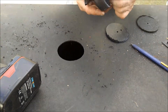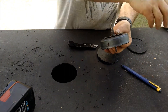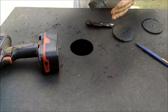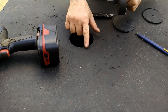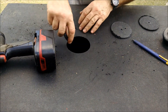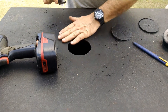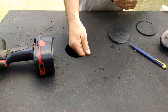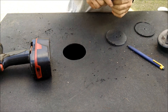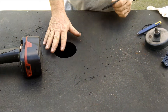The hole saw goes together with a piece for the inside, and for the larger size you use the other side and then it threads up. I'm running it right through my Craftsman 19.2V cordless drill — that does just fine. Because it's cutting through plastic and it does get hot, I had to use a drill bit and scraped around to make sure all the burrs are off. Be careful using a knife — you don't want to create a burr or make it misshapen; you want it clean on both sides. Once that's good and clear, pop the rubber gasket in. I'm also using black silicone sealer — a rubberized gasket material — and I coat both sides.